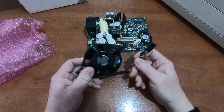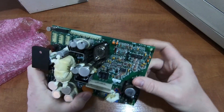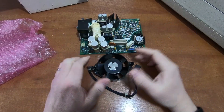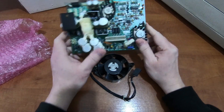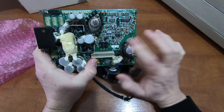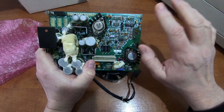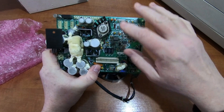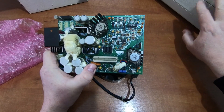The typical fault with these is the tantalum capacitors. On board here — and in fact there are some on this power supply — you can see these orange ones. These are tantalum capacitors, and the issue when they go old is that they go short circuit. Now that's actually a good thing in this machine, because there's a power good section on the power supply that monitors the rails on the boards to make sure there are no shorts. If it finds a short or a problem, it won't output the voltage to the machine, so you minimize the risk of damage to the unit.